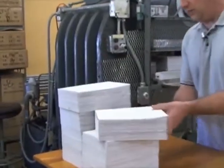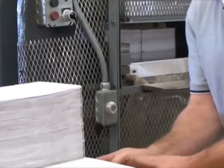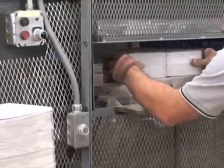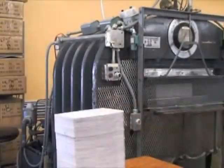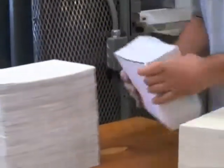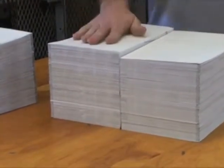In this step we are smashing. This is the process of taking all of the air out from between the pages. While the pages are open they hold air, so in this process we flatten down the Bibles and make them tight so we can get a good clean trim. We have just applied 200 tons of pressure to these Bibles. To show you how much air we have taken out, I will stack these Bibles together — this stack has been smashed and this stack has not.